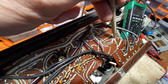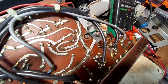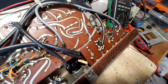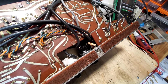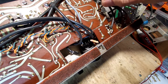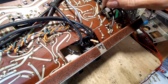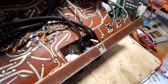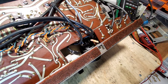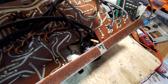What is that - have they joined those traces together or is that just gunk between them? The board's damaged there too. Let's see if we can get in close - are they joined together or is that just gunk in the middle? It looks like gunk. I think I'm just going to clean that out before we switch this on, just to make sure. The board's been damaged there - it's not fastened in properly and the screw fitting for that is all loose. I might need to get some kind of resin and build that back up.